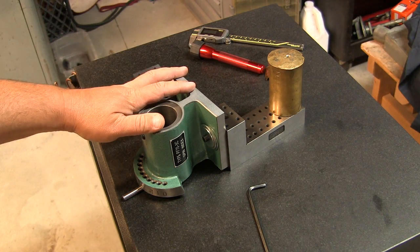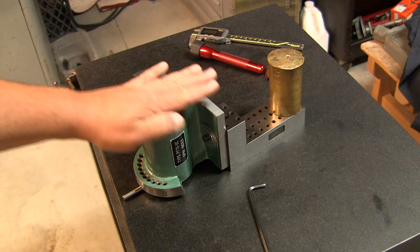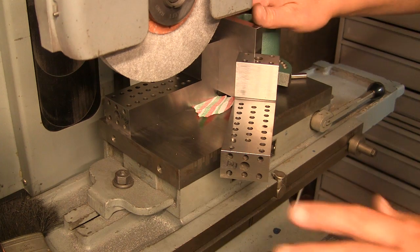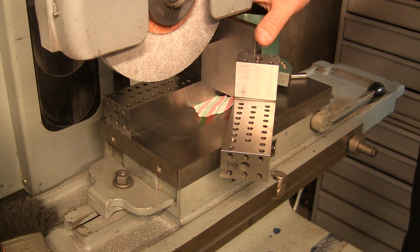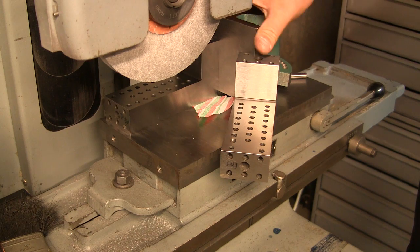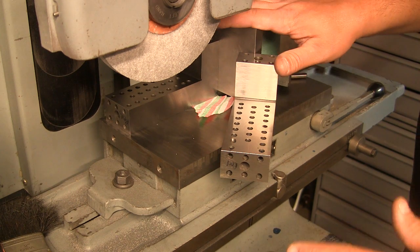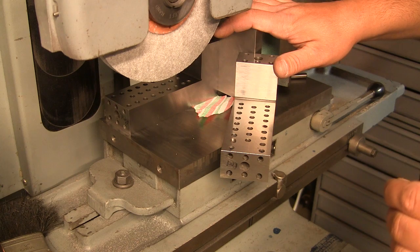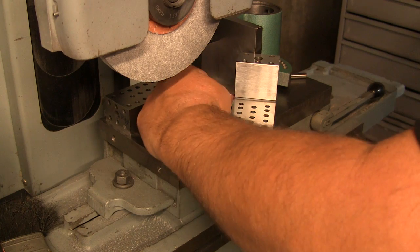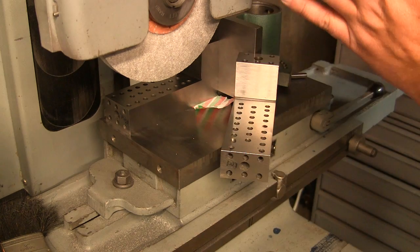So there's some fine adjustment that still needs to take place. We've got a little bit more work to do to really fine tune this, so I'm going to do that off camera because it might take a while. I've dialed this in as best as I possibly can. By nature of bolting a casting to an angle block with one small thin bolt and washers, this is very challenging to get perfect. I got it near perfect but noticed the tiniest little gap, so I got this tissue paper — the kind you find in a Christmas present — and put it right on the edge here, and it lifted it up and closed the gap.